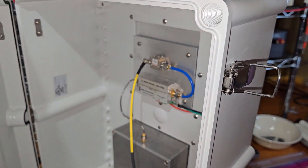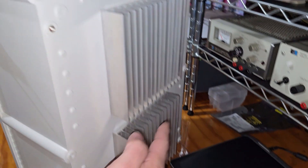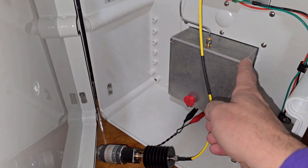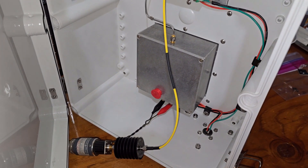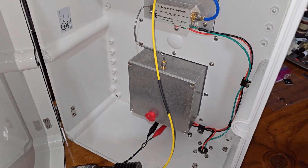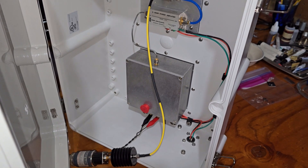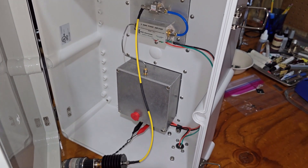While the power meter stabilizes, there are two heat sinks on the back: one to cool the RF generating circuitry — the low-level stuff — and one to cool the amplifier, to bring heat outside the case because it was going to get way too hot in the summer. When I tested this box without a heat sink, it got so hot it even exceeded 60 degrees C, and the OCXO took off because it couldn't regulate temperature anymore. So I decided we clearly need heat sinks. I couldn't believe that for 11 watts power dissipation the box alone wasn't enough to cool it. But it was a warm summer day, and this is going to be up on a tower subject to many warm and hot summer days, so I decided to try a little experiment.